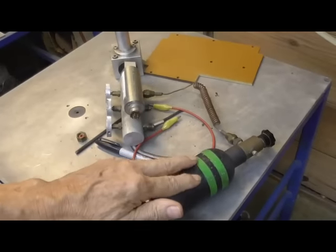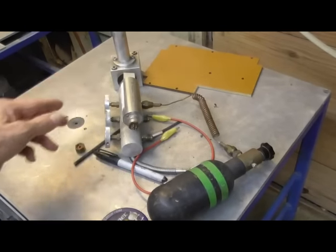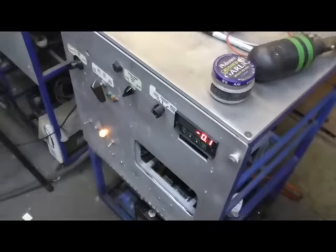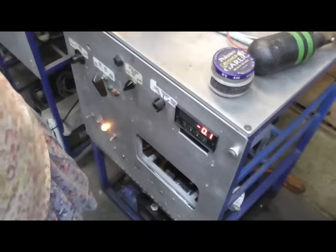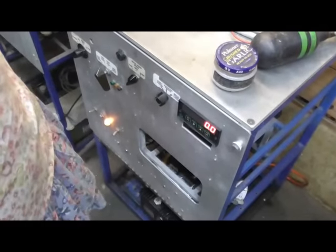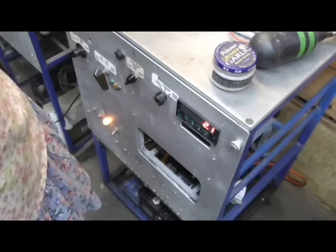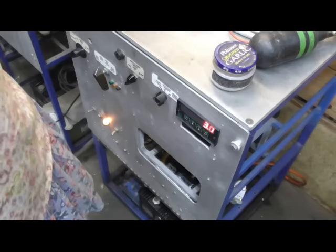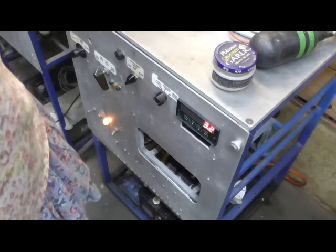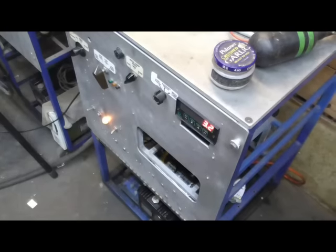We've got the tank of argon here. It goes into our manifold, and we've got a valve here that we can bleed it in, and we can watch it on the gauge down here to tell how much. I'm going to take it up until we read about 2 to 3 microns. Alright. That's what we're going to put in there. About 3.2 microns of argon. Alright, now we're going to seal the tube off.